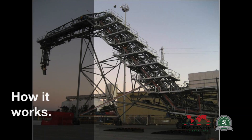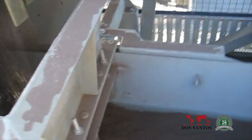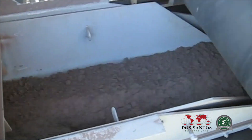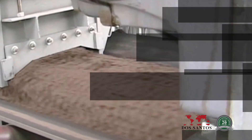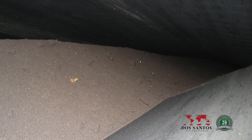How does it work? Material is loaded onto a conventional bottom belt approach before the sandwich entrance. The skirt width of a sandwich belt is narrower as compared to a conventional conveyor. This allows the material to be well centered with ample belt edge distance, ensuring proper loading for no spillage along the conveyor length, which is a great advantage to reduce dust emissions.